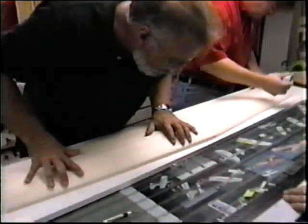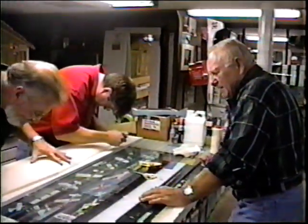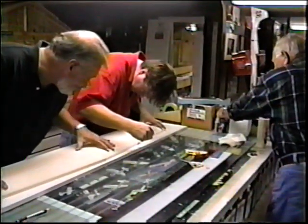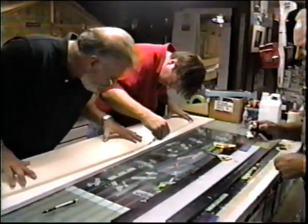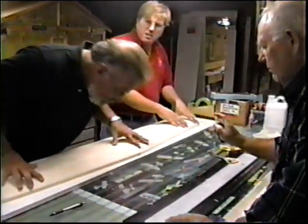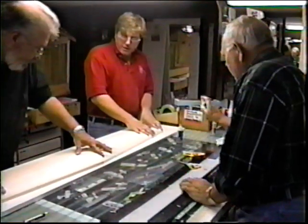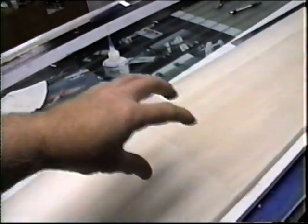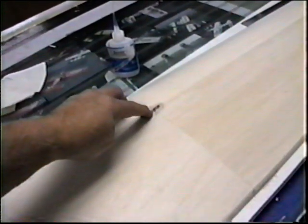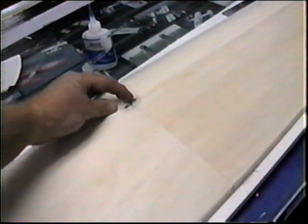I wish this stuff would go on. You may have to kick it, but try not to kick it with a lot of kicker. If it turns into popcorn, then you got to sand that edge. That's going to be a critical edge on a mold. Yeah, just give it a little mist. A little piece of 64th plywood is only there so we can identify, when we put the two clamshells together, this locates the bell crank bolt off into the other side, half of the bell crank throw.